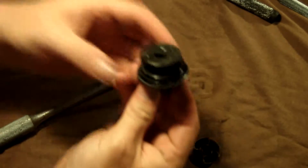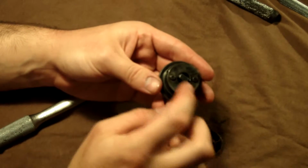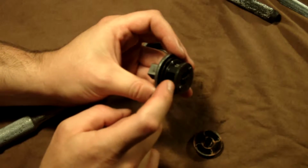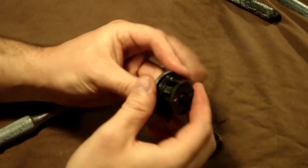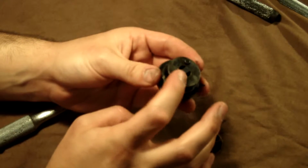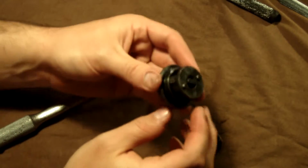And then this is the main gear, and this is the center portion that works back and forth when the selector plate moves on it. It has a spring in the center of it that has 2 check balls on either side, and they work against the back of these pawls where there are some detents, and you see the double pawls. They move the pawl either way on this shaft, so when it clicks that way, you can reverse it, and when it clicks the other way, you can go ahead and tighten. So that's how that works.